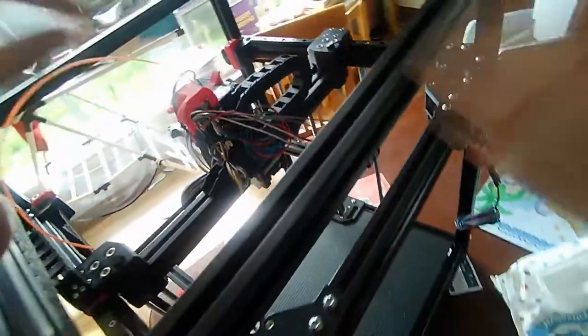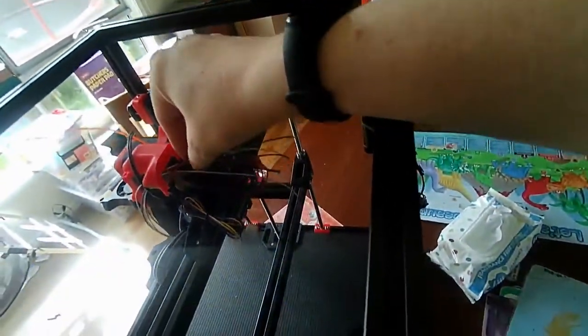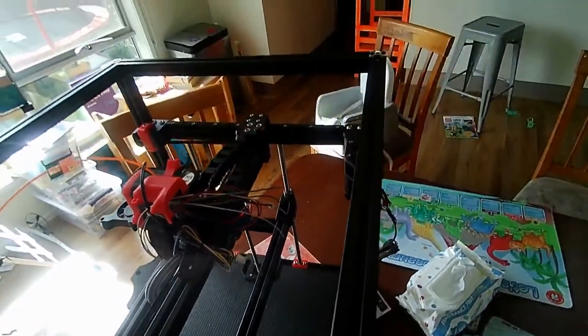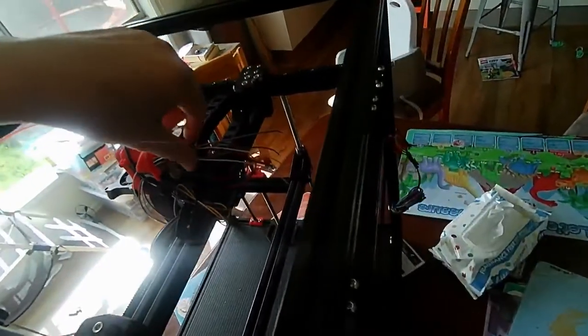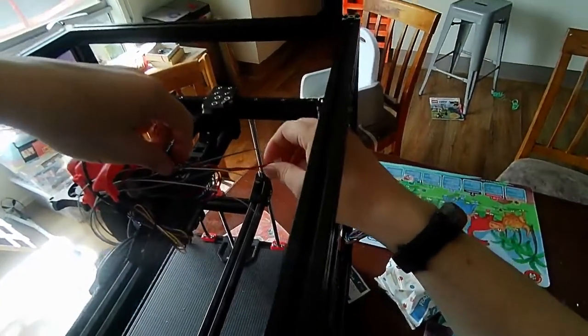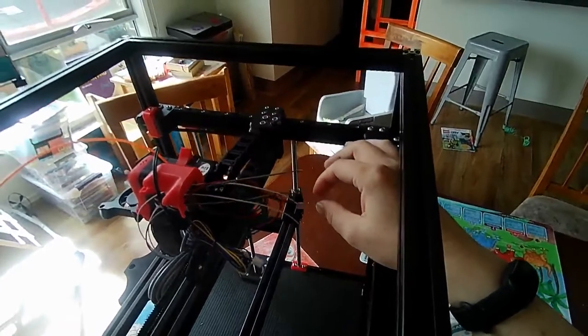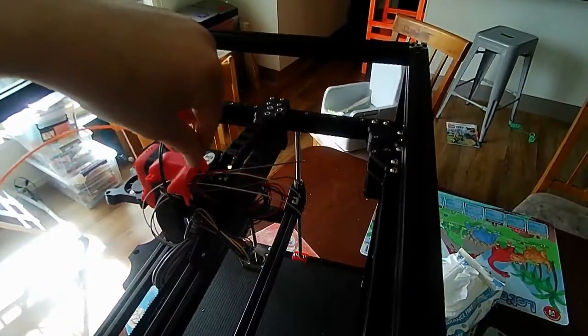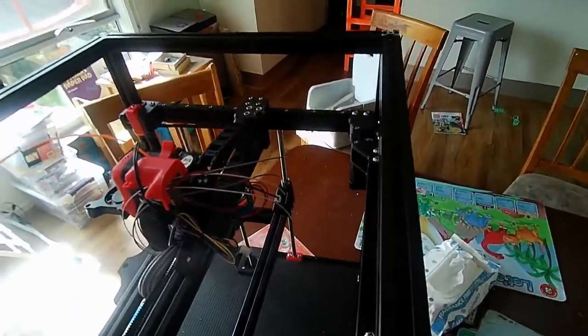So you can see here, wiring-wise, we've got red fan, which is the blower that is disassembled. Now these colors are going to be the same if you've used the stock BOM for these bits, by the way. So red is your fan. Now polarity wise, these will fit in as is without modifications to your SKR board. So remember that, because what you can do is make your Micro-Fit connectors, and at the end you can sort of go back to that if you want.